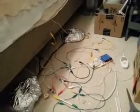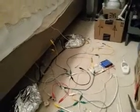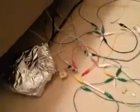So in this instance, I don't think it matters what direction the neon bulb is versus which side the resistor is on, because I tried it without the neon bulb, with just a resistor in this place, and I realized that there shouldn't be any link. So, to remind myself of that, I put a capacitor in there to ensure that there's no current flow whatsoever between those 2 points, and not just leave it up to the air. I'm accentuating the separation rather than ignoring it, because it's a very important part of the circuit.